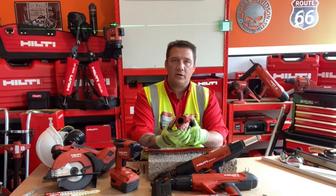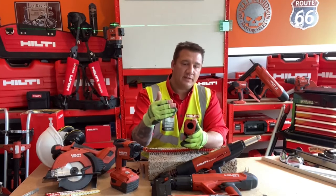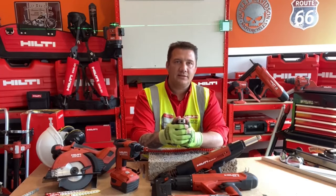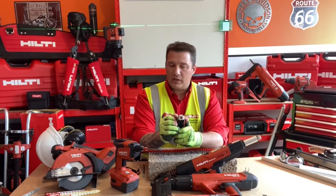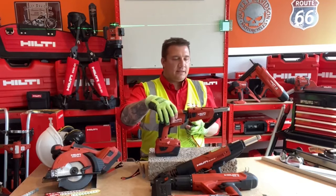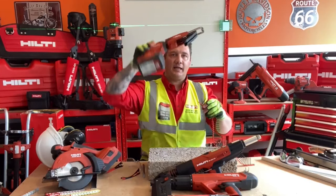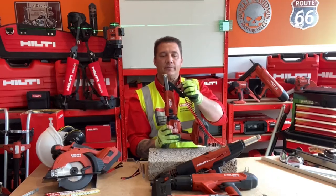We've still got the fine tune adjustment at the back, but it's now clear and numbered with plus one to seven and minus one to seven depending on the depth you require. It's also got a metal tip at the end — with the old plastic one it got broken and snagged a lot; this takes those issues away. Much like the SDM2, this metal plate gives you tight access into corners and is more wearable and durable than before. Instead of the fiddly threading method on the old one, this is a new improved single-handed motion, so if you're up at height having to hold plasterboard you can simply use one hand to thread the screws in.